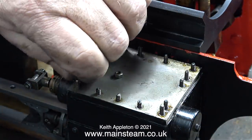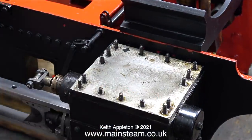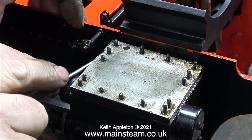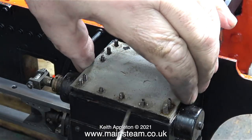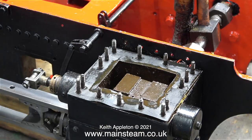The next part of the job requires some very limited ultraviolence in the way of a soft hammer — a copper-faced hammer, this one is. With a few gentle taps it loosened the cover, and here I'm lifting the cover up being very careful not to rip the gasket. And not unsurprisingly, inside the steam chest is a slide valve.